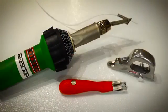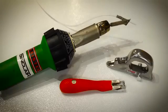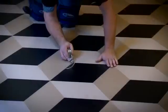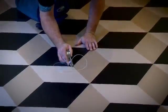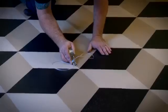Heat welding is the process of heat fusing two sheets of resilient sheet vinyl flooring together at the seam. Using a grooving tool, groove the seam to a consistent depth of approximately 2/3 the thickness of the floor or half the thickness of the welding thread, whichever is less. Take care not to groove completely through the backing layer.